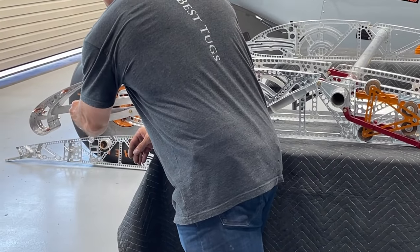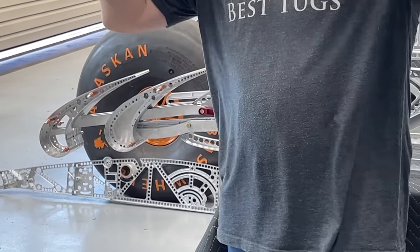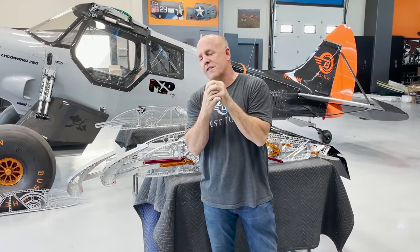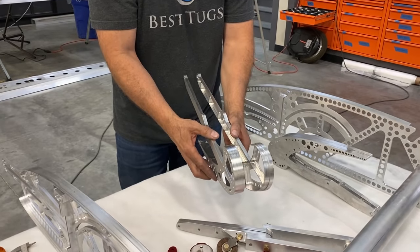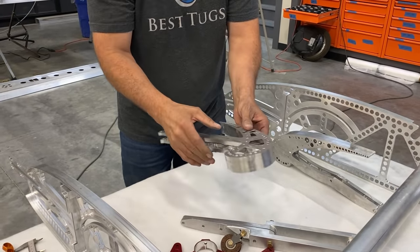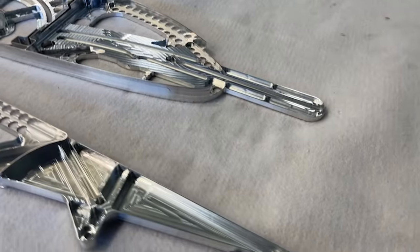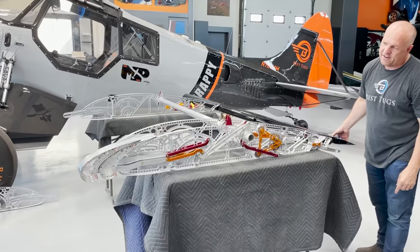The slats slide into the pockets all the way down, so there's an inch and a quarter engagement in each one and it can't get out. Rather than screws, it's actually a mechanical lock and there's no way for the slat to move and get out. And then some of the challenges was how to get a slat moving out of a wing. And so you can actually see a bottlenose front on it right here. And if you were to look close, the bottlenose goes way out to the front and the bearings are on the inside and my slats have to pass through each other.